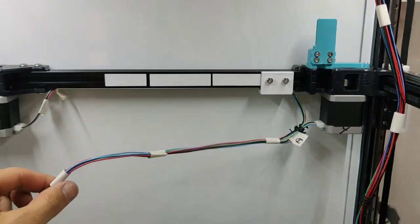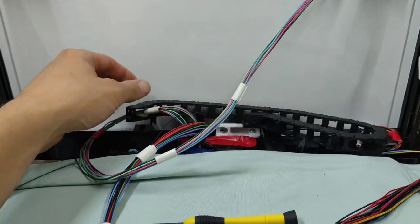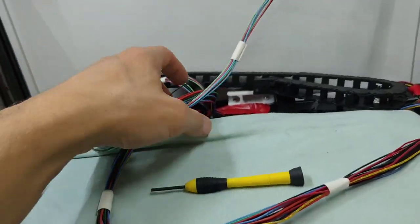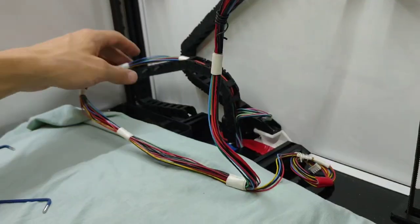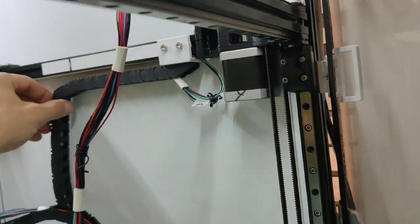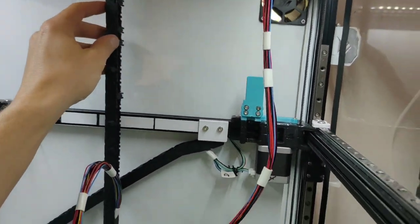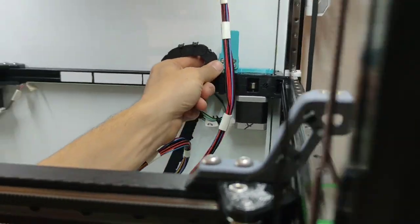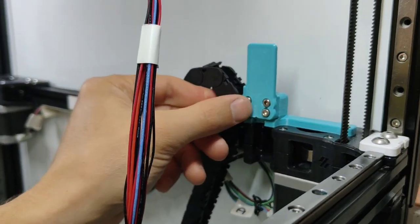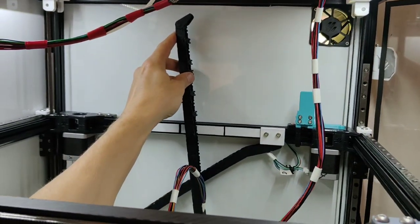Here we are back at it again. Got our XY cable separated and we're going to use the small cable chain for that. And then we've got another cable chain which uses the original mount and that's going to be fixed going vertical. So I'll get them wired up and show you what it looks like. Okay, so we've got the back chain attached and now we're doing the front chain which is going to sit vertically all the way up, and I'll make a mount for that. Something to note is the width of this chain is the same as this, I think it's just marginally thicker, but worst case I can put the cables on the outside if this doesn't work. So let's get this installed.